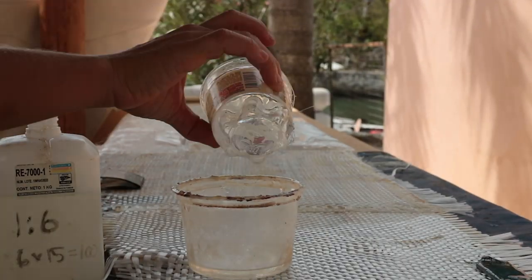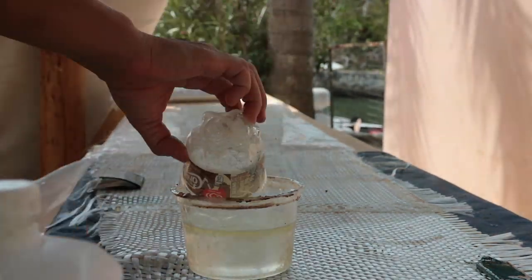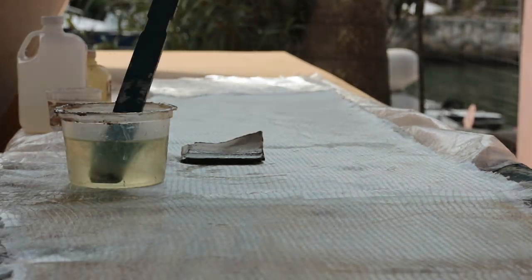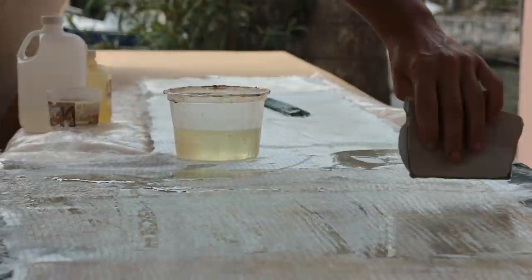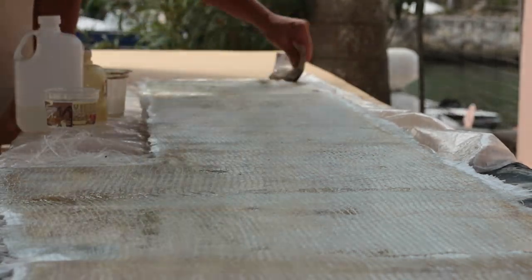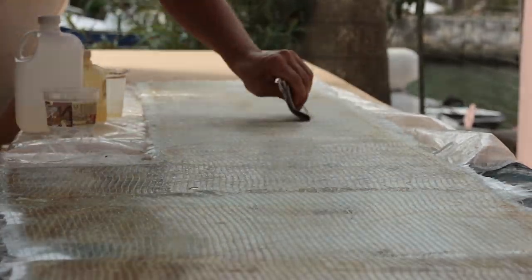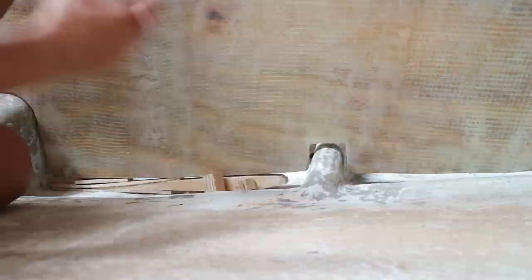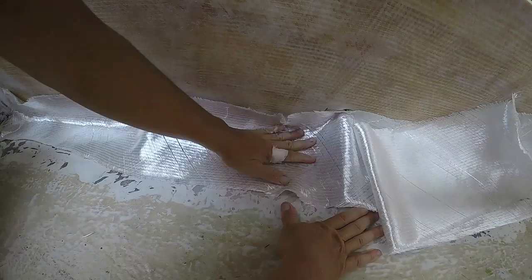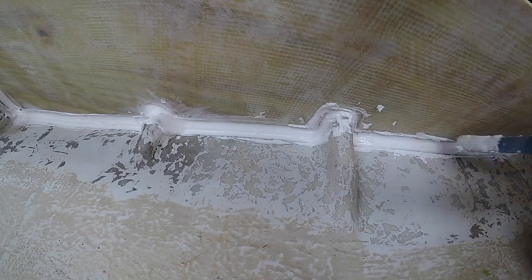Once sanded, the face was ready for that liquid creation potion — epoxy — and a little bit of fiberglass cloth too, just to add some strength and water resistance. Because of this inexact method, I had to take some extra care and time to gather little plywood bits and pieces to stuff the gaps so we wouldn't be wasting too much thickened epoxy to fill them. Some strategy and dry fitting with the cloth, and then it's fillet time, which forms a nice smooth curve that the cloth will adhere to without air pockets in the angle between the surfaces.